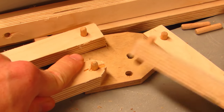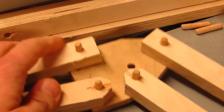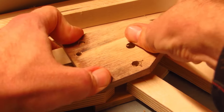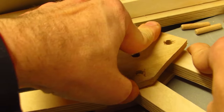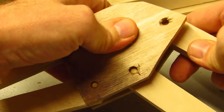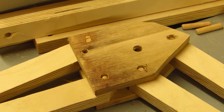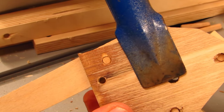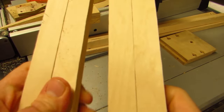They sit at an angle — I recommend something in the neighborhood of 45 degrees. That allows you to fold the arm all the way down. Depending on your geometry, you might have to cut a few corners to prevent interference. To keep the pieces from coming apart, we need two knee pieces to sandwich the slats. The main rule applies to both segments of the arm separately; using the same distance for both makes things a lot easier.